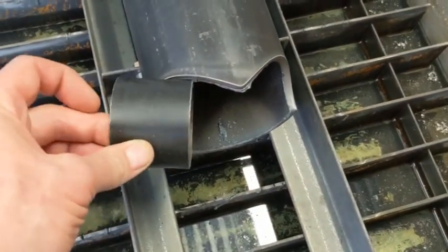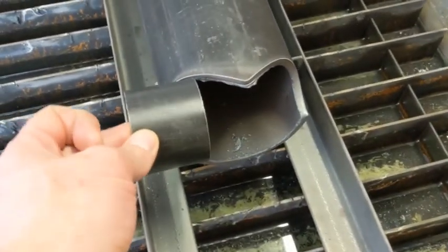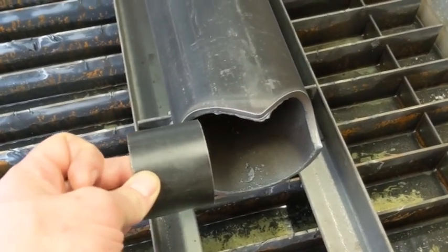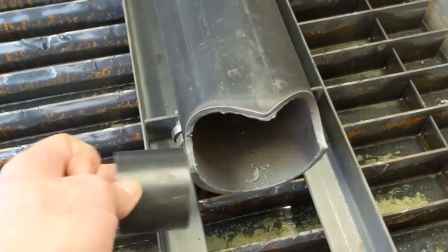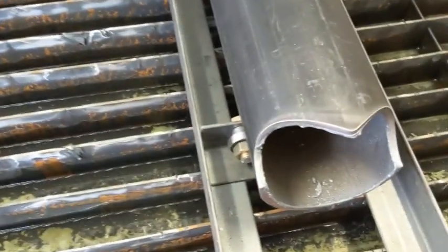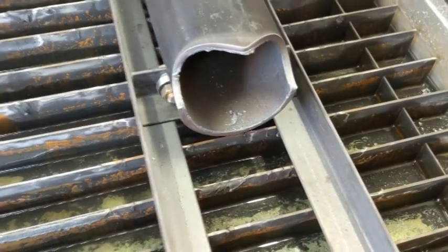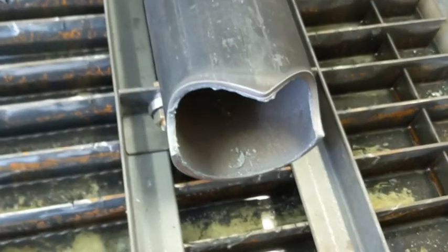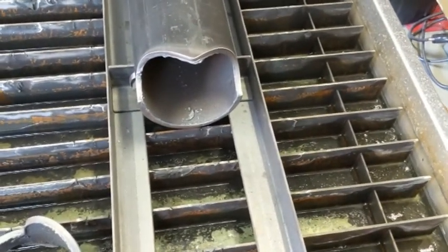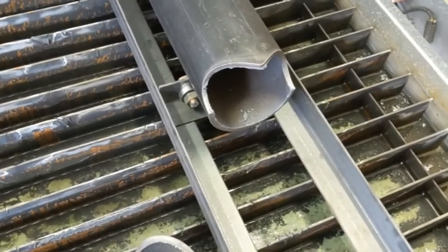Of course this pipe is supposed to be able to fit through there, but I haven't taken into account the thickness of the metal. When it cuts, it cuts straight down, so unless I cut the hole bigger in sections with the right diameter, I'd have to cut an oval-ish shape to push through the 5mm pipe. It's going to require a bit of grinder work still, but that's so much easier than my old method — cutting out a paper template, tracing it onto the pipe, and cutting by hand. That's how I lost litres of sweat doing that. So this is a success.